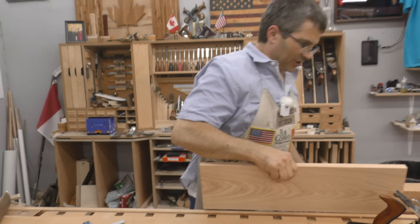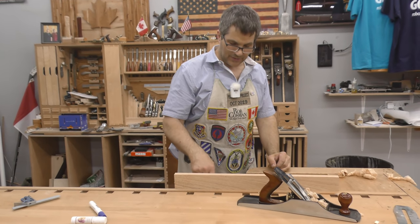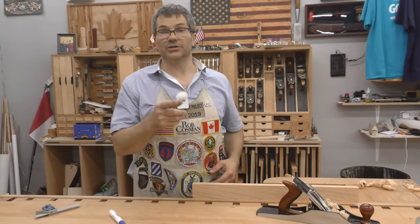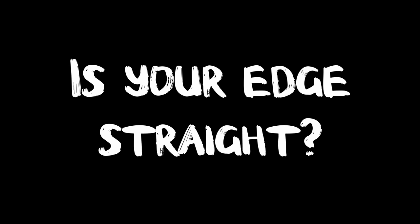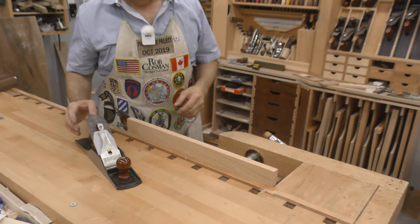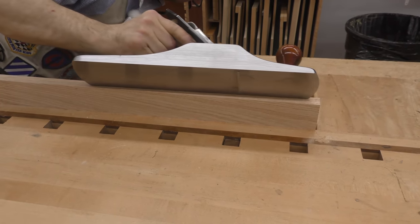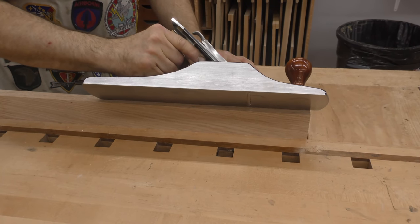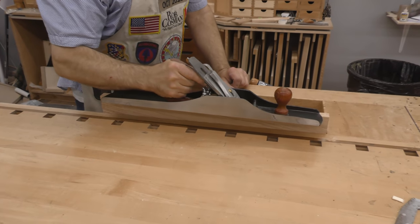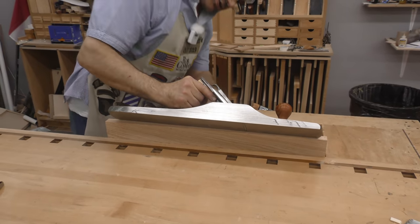Last thing before I show you what I think is the best way to do this — we've got to verify that that edge is straight. Right now it's square to our reference face, but it may not be straight from here to here. There may be a hump or a hollow, most likely a hump. This is the part that is actually easier with a really long plane. I'm going to set it here like that and look underneath to see what we've got going on. I'm also going to try to pivot — if I can pivot the plane in the middle, then I know I've got a bump. I'm going to use a longer plane and see if that tells me anything different. When I'm doing this, I'm tipping it so I'm referencing just off the edge. If that was perfectly straight front to back, it wouldn't pivot. So it's showing me that I have a bump.